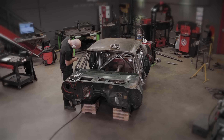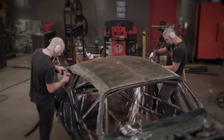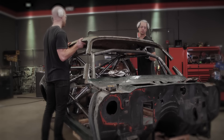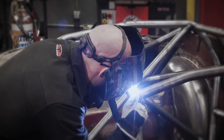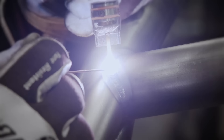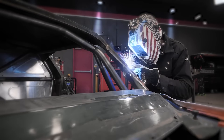Finally, the last method is cutting the roof off of your vehicle. This can be quite complex and it often helps to have multiple people available to reinstall the roof after welding. I do prefer this method because it completely opens the top of the vehicle and allows the use of simple flat plates to attach the cage to the floor. The biggest downside is reinstalling the roof, welding, and finishing the seams. With all of that said, the method we're going to be using for our car is the plinth box method, and I've got a lot of prep work to do, so let's get started.